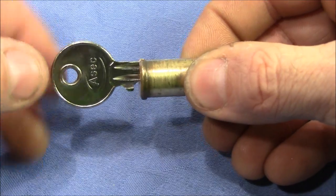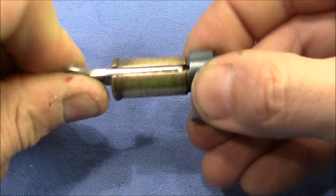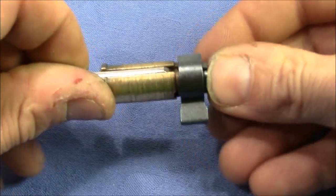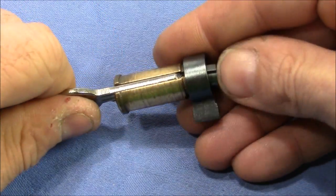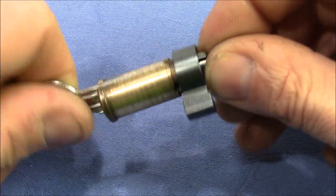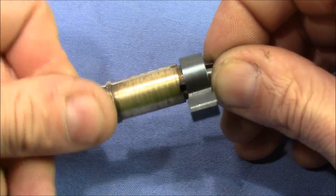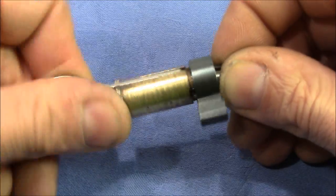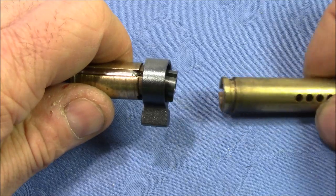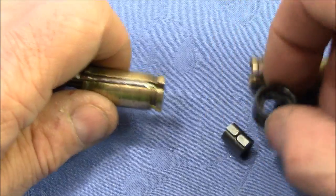Key is again outside a little bit, now I move it in. And now the cam and the plug are locked, and when I turn the plug, also the cam turns. And if I can manage to hold this, the other side, so the right hand side of this actuator, is not connected, and so I can turn the left side plug without interfering with the right side plug, where the shear line is not clear. So that's the way this works.